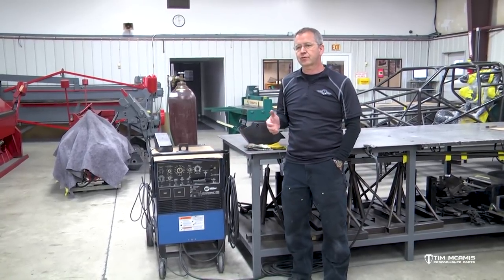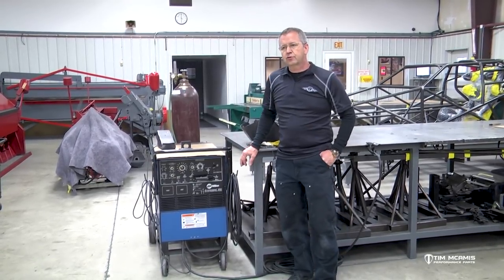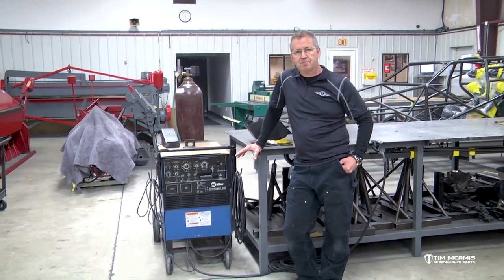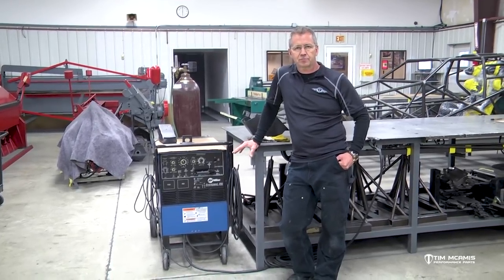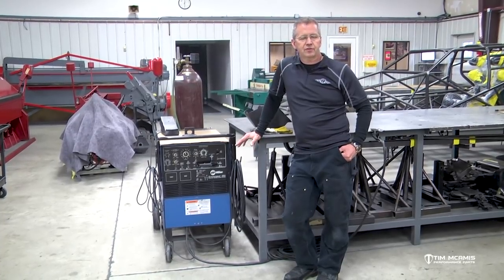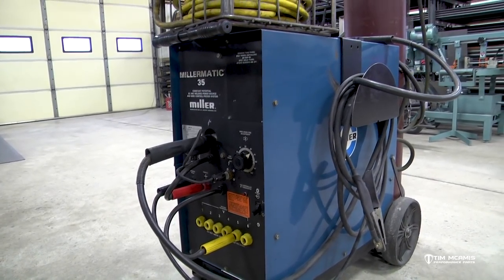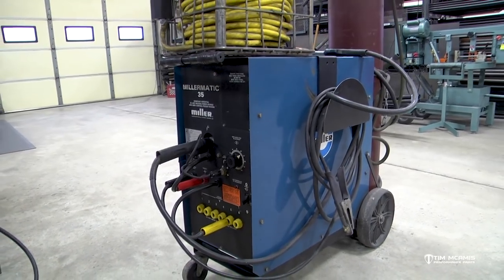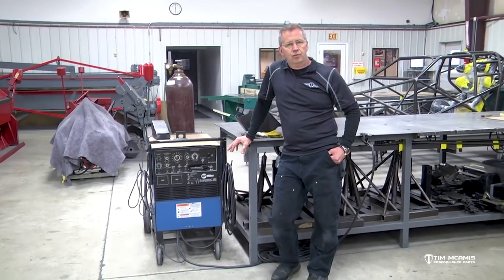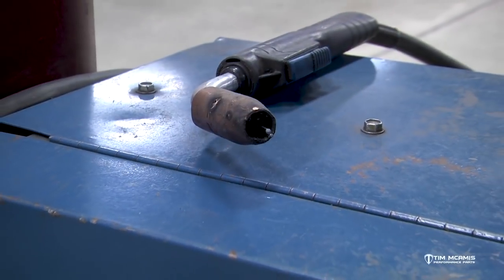This video is going to be a basic intro into the type of welding that we do and the type of welders that we use. You might have heard of a MIG welder, or a TIG. MIG and TIG are two common types of welders. MIG stands for metal inert gas, which is basically a wire feed. Wire feed welders are great for lots of applications. They're especially good if you're building a mild steel chassis, putting a roll cage in your car, or making some mild steel brackets. The wire comes down the torch head with the gas, and it arcs when it hits the metal and produces a very nice bead.